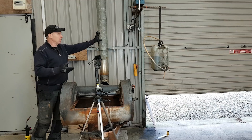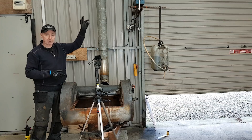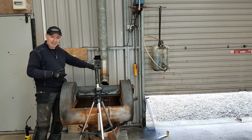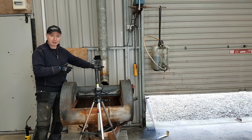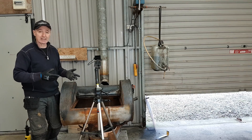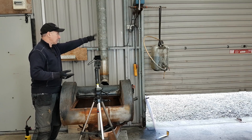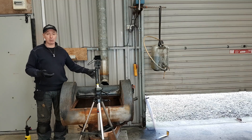This is 6-inch flue. It goes all the way through to the roof — 14 feet long from here all the way to the top. I've got some stainless steel pipe now. I made an adapter so that I could put ordinary stainless steel pipes on. There are a million different ways of doing this — I could have cut a 45 on this and just had the pipe coming out, but I had some of this already so it was easy enough to do.